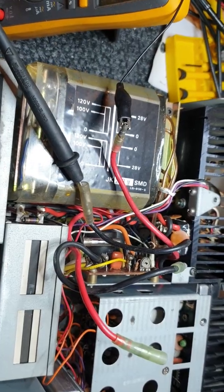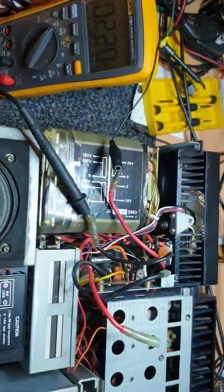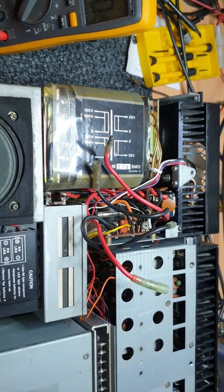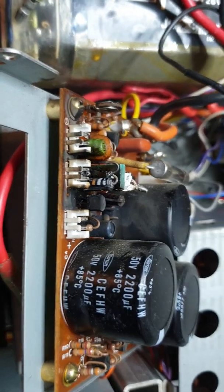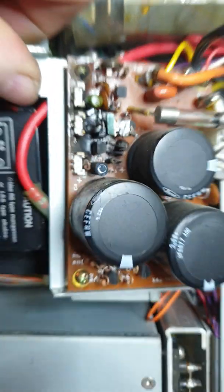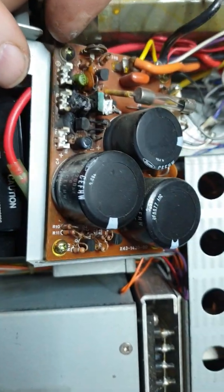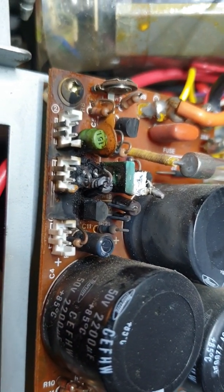The first thing we do — this may not surprise you — is we pull out the 240 volt lead, because that's the dangerous one. Let's quickly pull that board out and see how much of the board's been incinerated. So if I said to you: do you think this got hot — reasonably hot, very hot, or Fahrenheit 451 flames? That resistor right in there — geez, they do a marvelous job of going up in smoke, don't they, these supplies. That's quite a mess. The fuse did a good job.